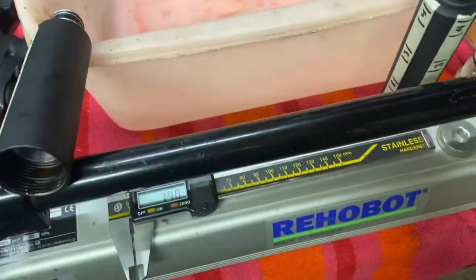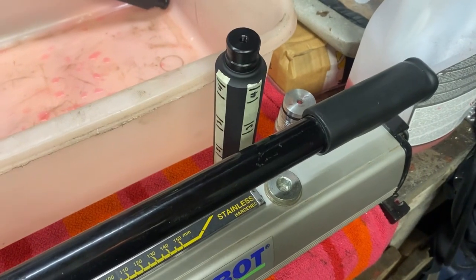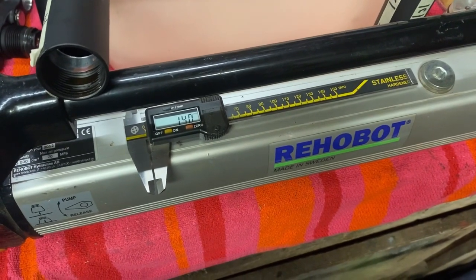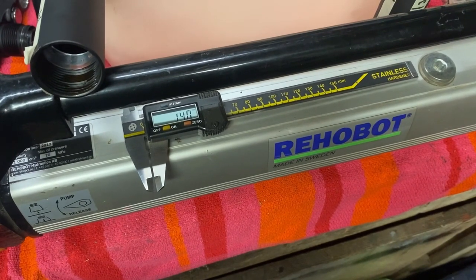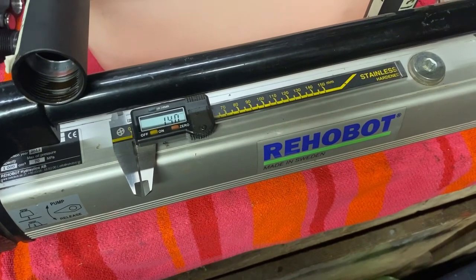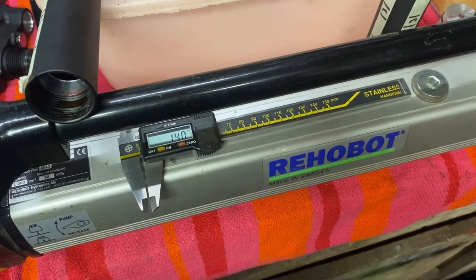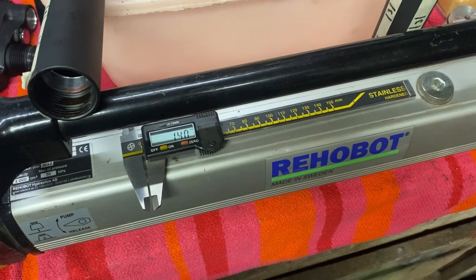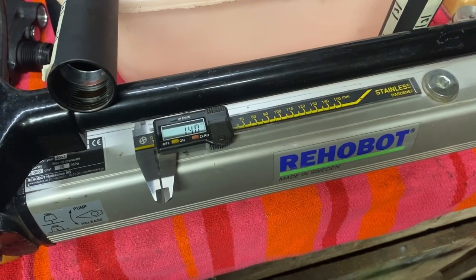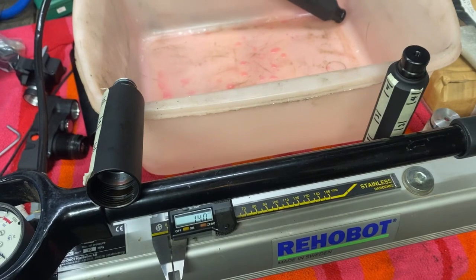and to be sure that we are not just 20 bars under, I'm going to sacrifice this pair, and I'm going to go just above 500-ish, so we can see that we are not close to the yielding point. If it yields at 500, then it's similar to the other cylinders, and that will conclude this. If it doesn't yield, then it's pretty much sure. Well, we'll get to that part when we get to that part. Not going to say anything about that just yet.